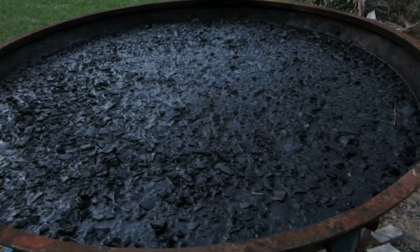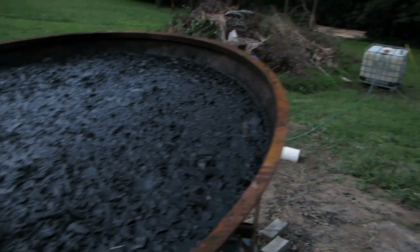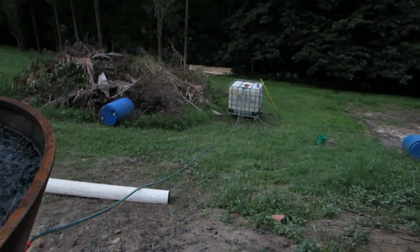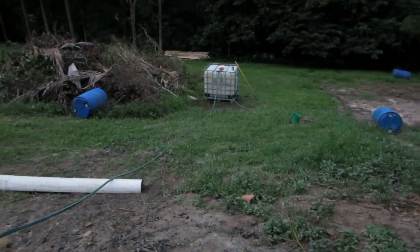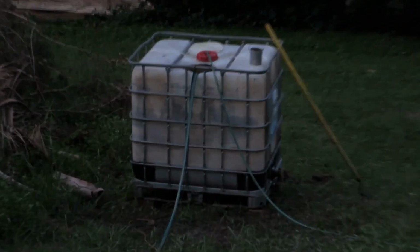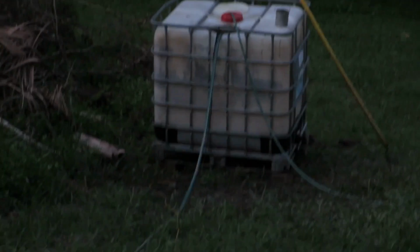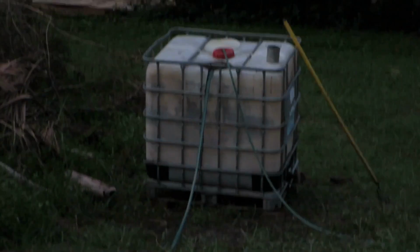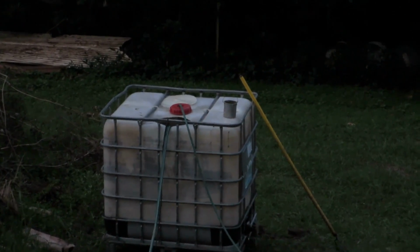Okay, we're at the end of another day. Been a busy day today because we needed to get the bulk tank and set up the plumbing and the pumping. But once we had done all that, we had the bulk tank, 1,000-liter tank, connected to the 1,000-liter kiln through the hose and valves. We titrated the biochar, found the pH. pH was about 8.5, and calculated the amount of phosphoric acid, which turned out to be about 1 liter.